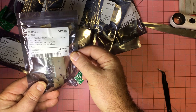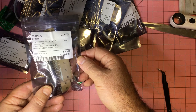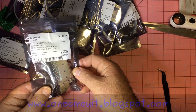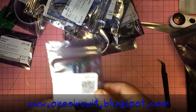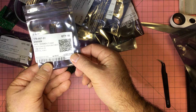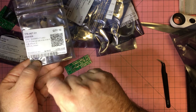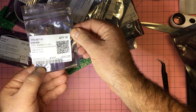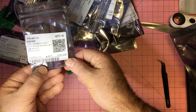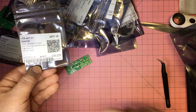And likewise this one — it's an unusual quantity of 70. The quantity is strange; I'll have to check the order. It says TO-92 microprocessor and microcontroller supervisor, so I'll look at that more closely. Next are SI4599 MOSFETs in a SOIC-8 package, and these are for a nice little project I saw online — basically building a watchdog timer circuit to reboot your microcontroller if it hangs.